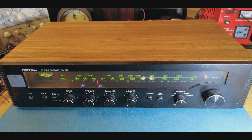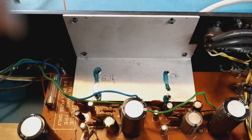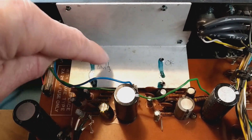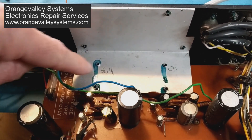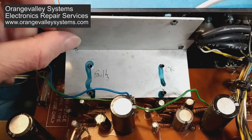This is a project to convert an old Rotel receiver — the amplifier chip has failed — to use a modern Class D amplifier board. The amplifiers are under this metal plate. This is the heat sink where it attaches to the back panel of the unit. This chip works under there, and this is the faulty channel, so I've already taken the screws out of it.